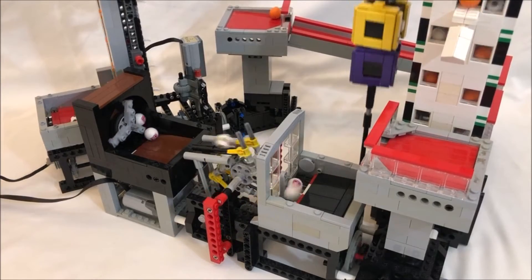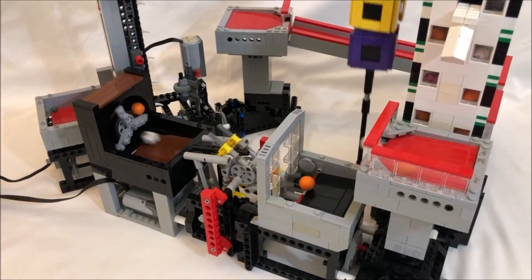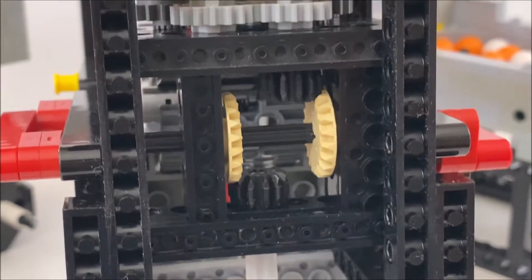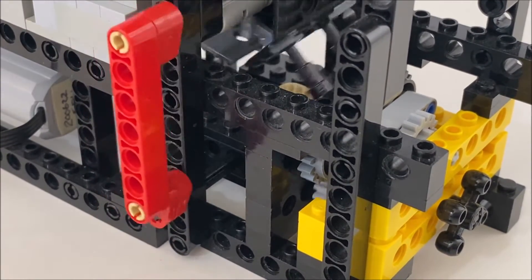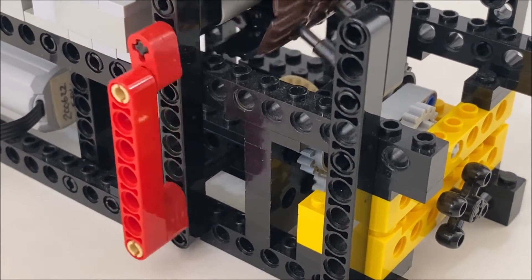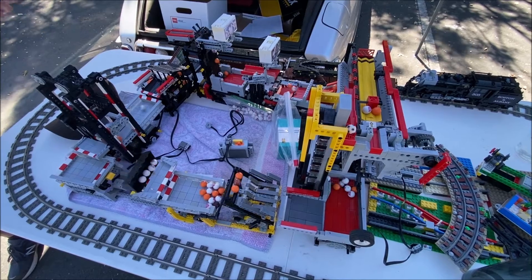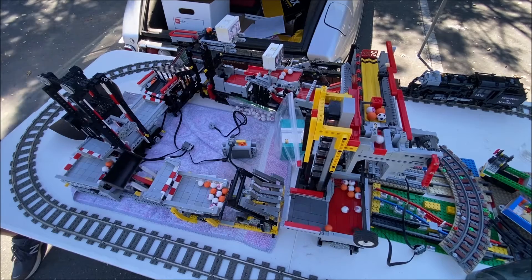The actual drivetrain has more in common with my tiny wheel than the old chainlift. A driveshaft in the base connects to the lower sprocket with cranks. These connecting rods, like the ones on steam locomotives, use fewer parts and have less slop than chains. This overall arrangement allows me to add my shared power connectors, which run with a 1 to 5 reduction off of an M motor.